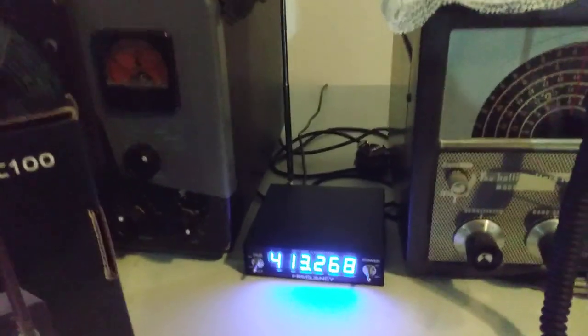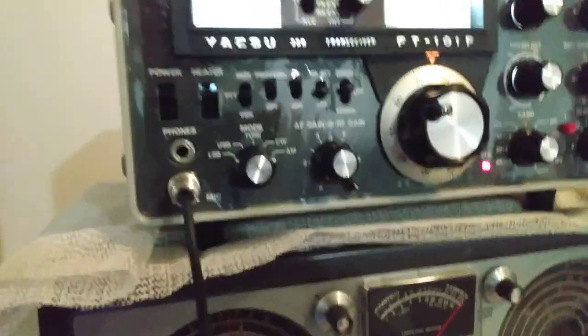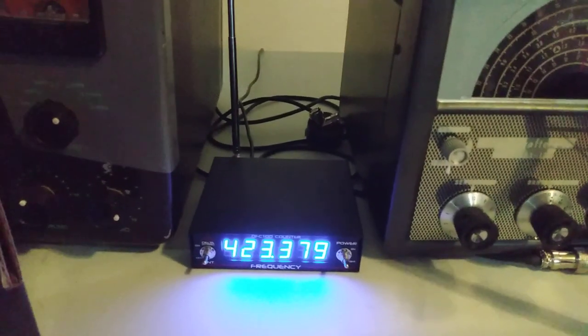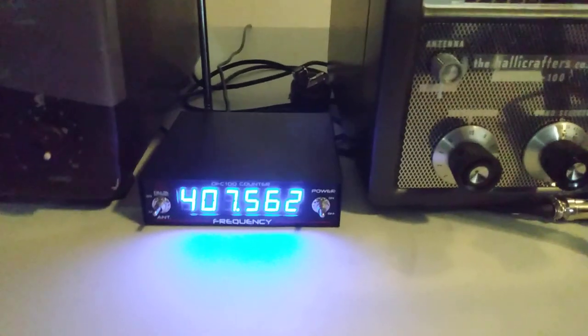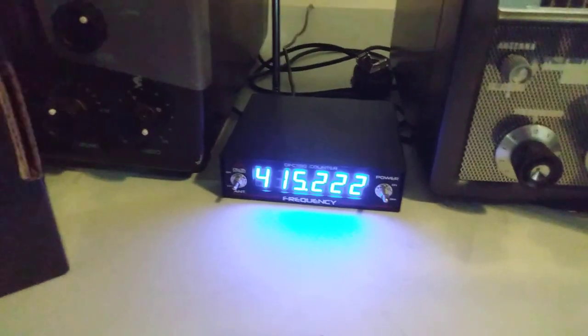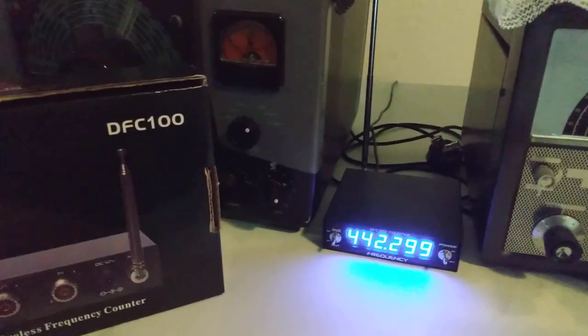Anyway, main focus here — the frequency counter. What I like about this thing is it's RF sensitive enough to where I can just key my Yaesu up, and I'm just going to show you here — go ahead and key the microphone — and it's dead-on. It shows my transmit frequency. I don't have to run a real heavy carrier; running about 30 watts dead key coming out of the Yaesu right now, and that is enough to make it pick up. It might pick up with less, I'm not sure, but 30 watts dead key, and of course it's picking up my antenna which is an outside 5/8 wave ground plane.